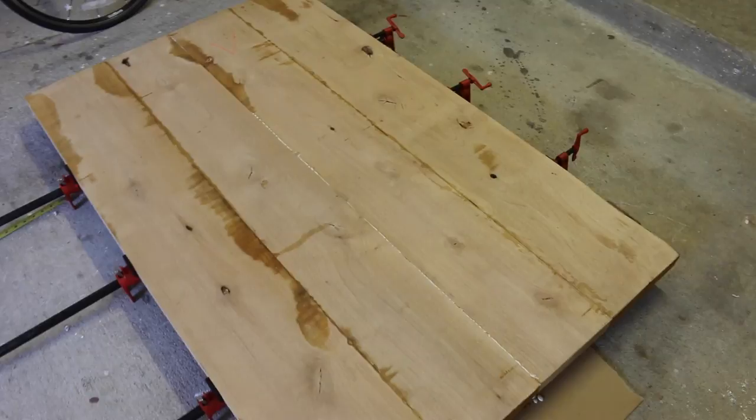You're going to let this sit for at least a few hours — we actually let it go overnight. Then the next day, we glue another set of two, and now Ryan is gluing the two sets of two together using the same method. Just put glue down, line the boards up, and clamp them tight. Let this sit for a few hours or overnight as well, and there is your tabletop.